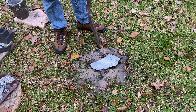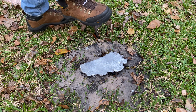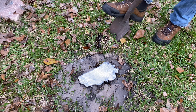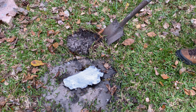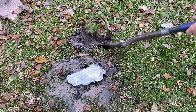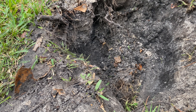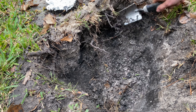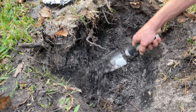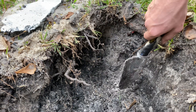Since this one's a small one, I'm going to have to dig it out pretty carefully. What I do to dig them out is I dig a hole to the side and then slowly work my way in towards the casting itself. Now that I'm getting close to the casting, I'm going to start using this little shovel so I can feel more easily before I put a lot of force onto it, potentially breaking the casting. Sometimes the casting will only be held together by one single tunnel, and that puts a lot of force into that one tunnel — so if you just hit it wrong, you could snap it.